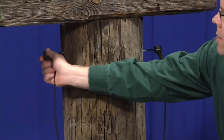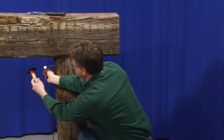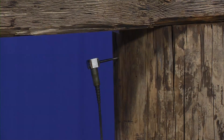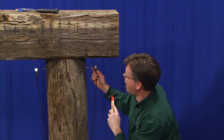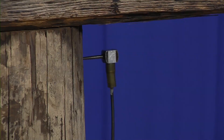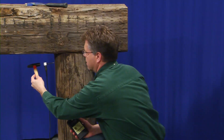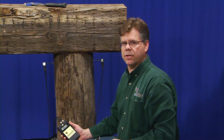The probes are easy to insert and remove from the piling — it's a simple tapping-in process. Each probe is inserted about a quarter of an inch so that it's firm, sound, and with good attachment. We want to line up the opposite probe directly across at about the same level, again inserting it about a quarter of an inch into the member itself. To complete the testing, we want to strike the probe sharply and consistently, without driving the probe deeper into the wood, which potentially changes the time.